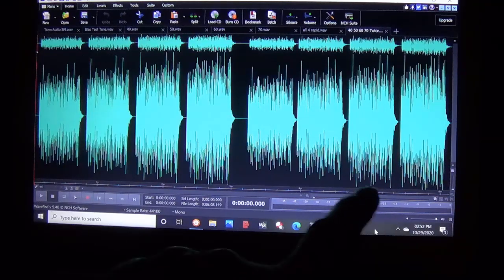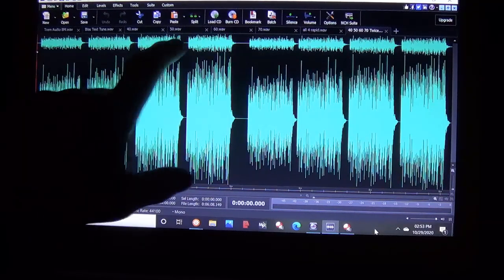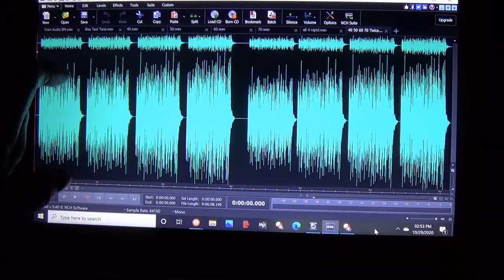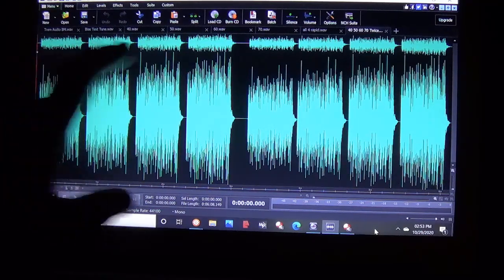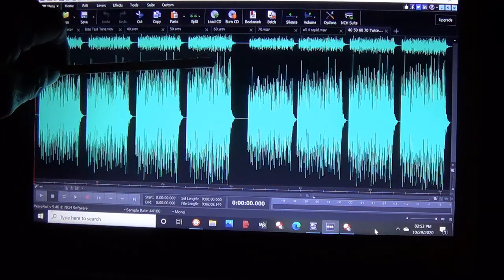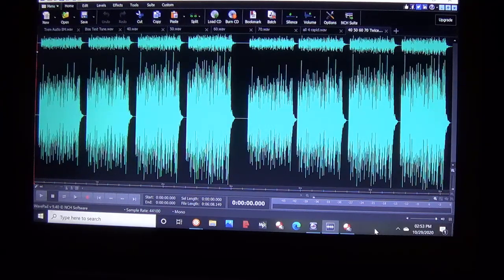And as I said, this agreement gives us a lot of confidence that the data that we're looking at here is reliable. And what that data tells us is that the amplitude of our signal, the volume of our signal, does indeed increase the higher or hotter we bias the output tubes. At 40%, the output volume was minimal. At 70%, it was maximum. In fact, you could take a straight edge and put it right along here and draw a straight line along the crests of each of these successive samples.